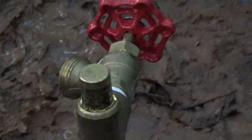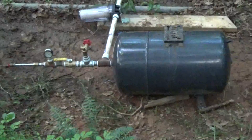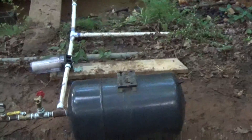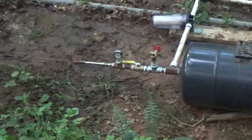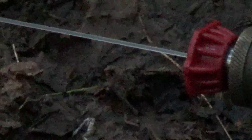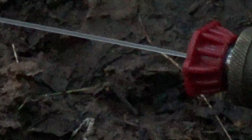He added a small bladder tank to keep things working smoothly. The idea is to take the pressure produced by the ram pump and keep it very close — within 10 feet — producing this ram jet. He's sustaining about 40 to 41 psi, and has run it at 48 psi sustainably. He thinks he can get it to 50 psi sustainable, running year-round.